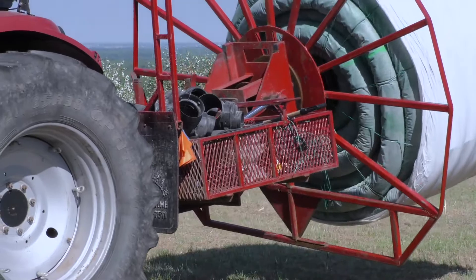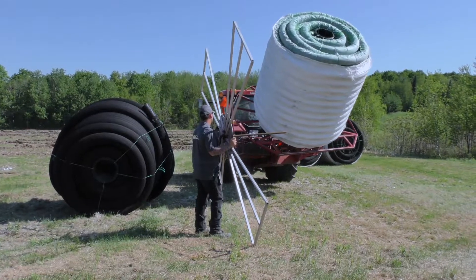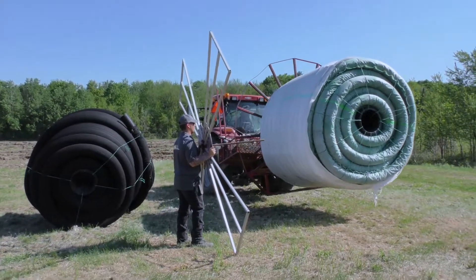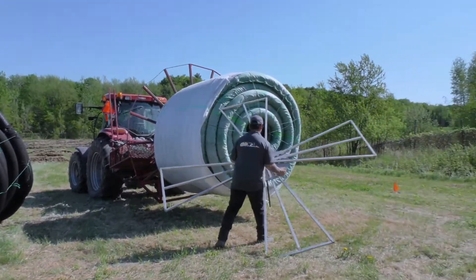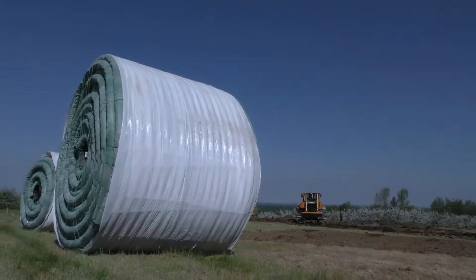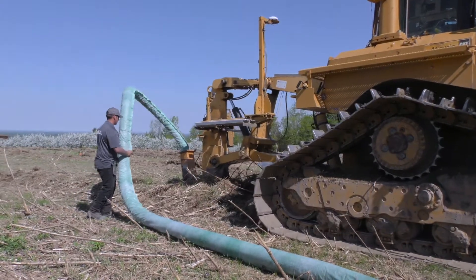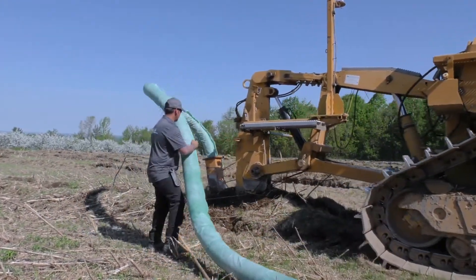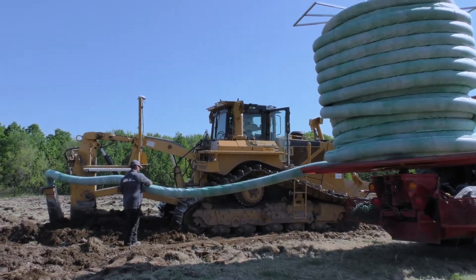In this video, two types of filter will be presented: the 250 micron non-woven geotextile made of polypropylene, and the 450 micron knit-type geotextile made of polyester. Soleno is the first manufacturer in Quebec to produce a 250 micron non-woven geotextile. Due to their three-dimensional construction and filter opening, non-woven geotextiles such as the 250 micron are versatile and allow the filtration of many soil types, unlike a woven geotextile. The 250 micron is also the most efficient for filtration and permittivity.